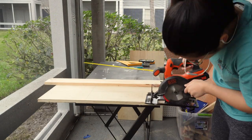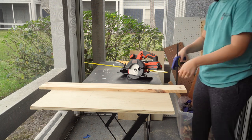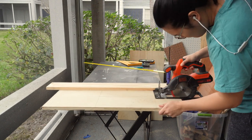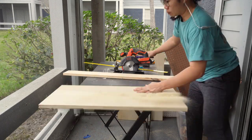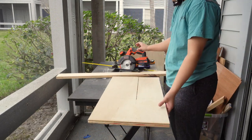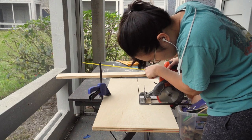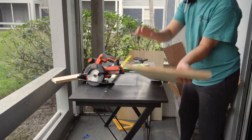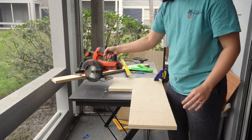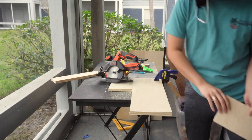It looks pretty good. Then it was time to cut the shelf pieces. This is where I saved a ton of money — from my previous cabinet I had saved up a lot of plywood I didn't use, so I saved a lot of money by reusing it. The only things I had to spend on were the metal pieces and the back sheet. I'm cutting 18-inch by 6-inch pieces — this is where my tissue paper will sit. Then I'm cutting four-by-six-inch pieces, but I realized five inches would look better so I went back and cut six-by-five-inch pieces.